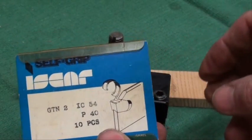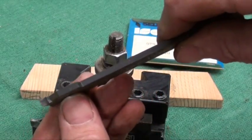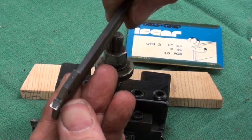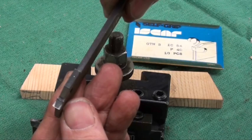The thing about these carbide tips is — you can see the little groove in the middle there — it kind of curls the chip so the chip becomes a little narrower than the groove, and the chip can escape really easily.